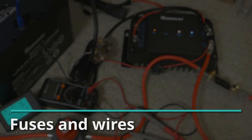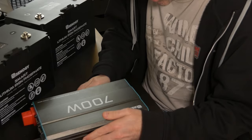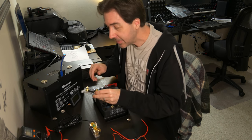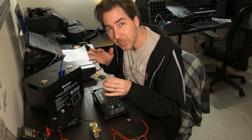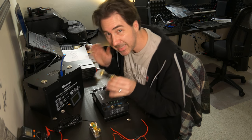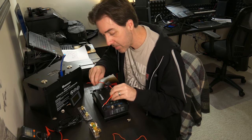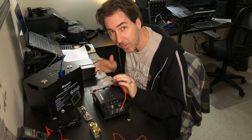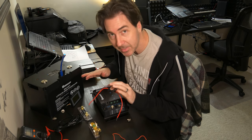You'll need some fuses and wires as well. Your new battery bank should have a fuse connected to the positive terminals, and high-current devices like inverters should also be fused to prevent damage in the event of a short. This ANL fuse hooks up directly to the battery — if there's a short, it will blow and cut everything off instead of damaging the equipment. There's also a smaller fuse for running a line directly to the positive on the battery, because anything like that should have a fuse on it just to be safe.